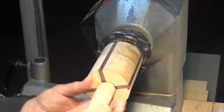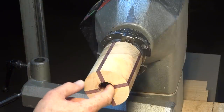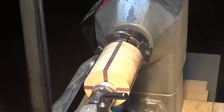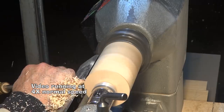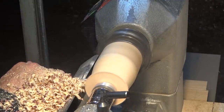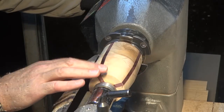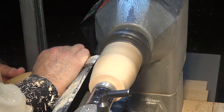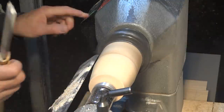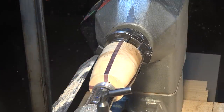So now I'm going to finish shaping this piece. I'm just going to put a cone on the live center in here to keep it steady, do a little shaping with a 3/8 inch bowl gouge. I'm turning at 2,000 RPM. I think I'll do some cutting with the skew chisel — that is not a clean cut. I'll have to stay with the gouge.